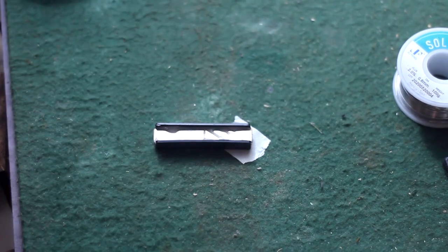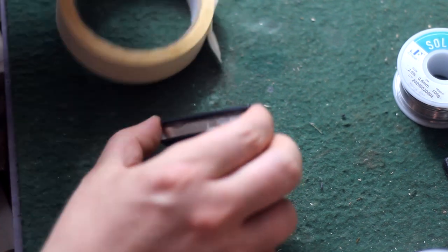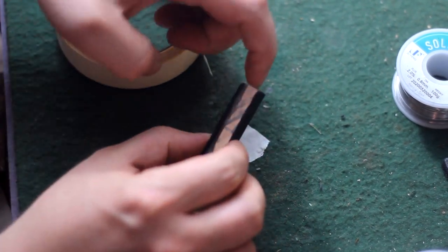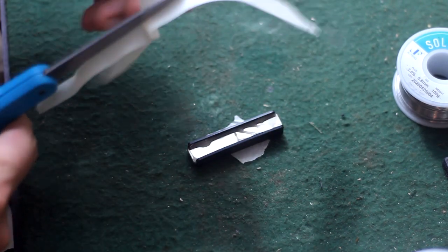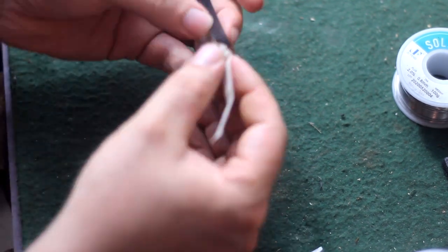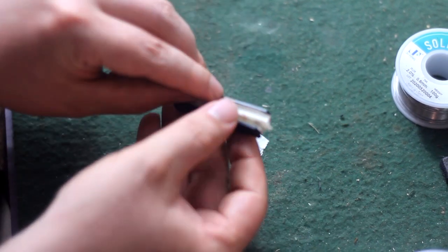Okay, now we can place that lead on this bobbin and start wrapping some magnet wire on here. But this being a metallic magnet, you can go ahead and start wrapping the wire on here as long as you put some tape on the lead wire where it's soldered. Over time, as it degrades and some of the poly might get scratched or whatever, corrosion happens, it's a lot more likely to short out on this metal.